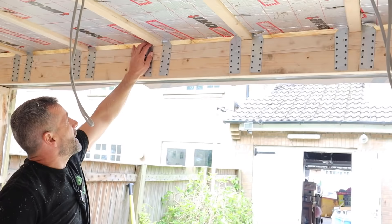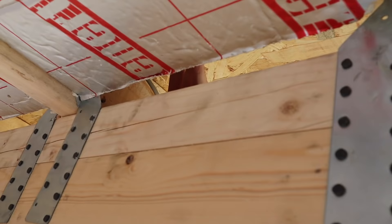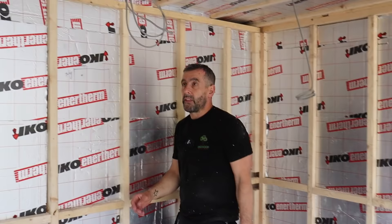We've got a little bit more insulation to do over here — you can't get your 100mm past the upside-down joist hanger, so we'll go to the outside and fill that with rock wool so you've still got full insulation over the full building. That's your insulation done. We'll finish these little bits, get it cleared out, and then we're going to put a vapour barrier on.